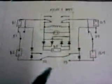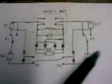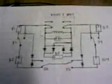The way I want this circuit, I just don't have it done yet. This is the way the circuit's supposed to be. As you can see, I've got the other switches and everything in here. With this layout, this kind of follows somewhat like a Tesla switch, with my little added extras. With these switching mechanisms, these will automatically kick it back and forth, series parallel, and switch everything back and forth. That should allow these batteries to not overcharge or possibly get damaged.